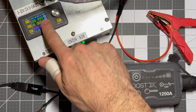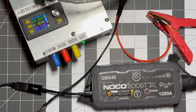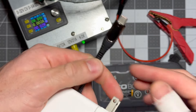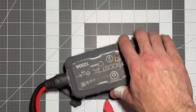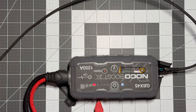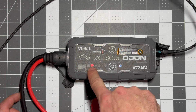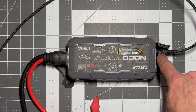Okay, the battery pack is up at 10 volts now. So I want to disconnect this external charger that is circumventing the BMS and instead connect up a regular charger to the USB-C port that will flow through the BMS and be controlled internally by the NocoBoost. To supply power, I'm going to use this Apple laptop charger and I'll use this cable which has the little screen on it to display the wattage that's flowing inside. We have four watts showing on the display switching between four and five watts with power delivery. The power light is on on the NocoBoost as well as this breathing indicator on the state of charge meter. So I'm going to let this sit here for a while and check back in to see if the wattage goes up indicating a fast charge.